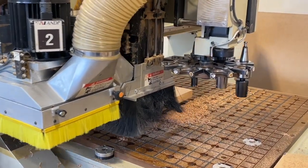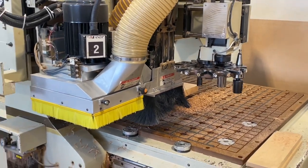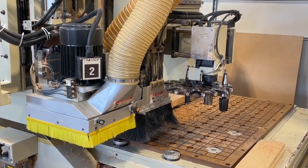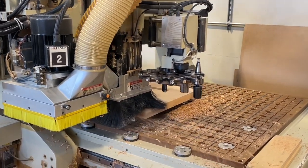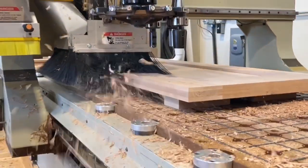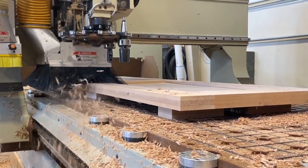You'll also see that they're utilizing a Benz aggregate. That means this machine is aggregate ready and capable of using them in programs. This machine will come with a single 10 horsepower Becker vacuum pump, as well as 30 ISO 30 tool holders and collets. Tooling is not included, of course.